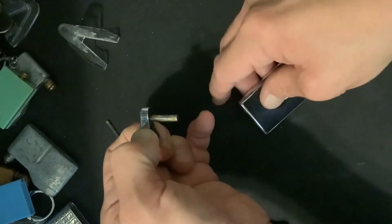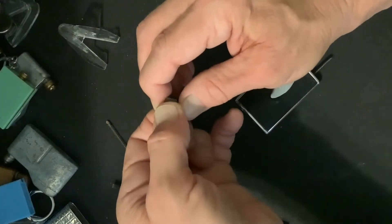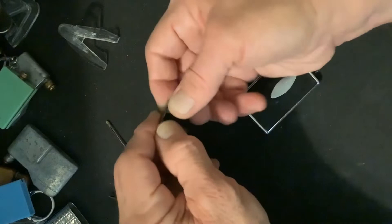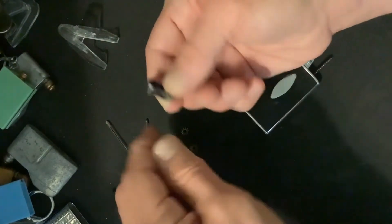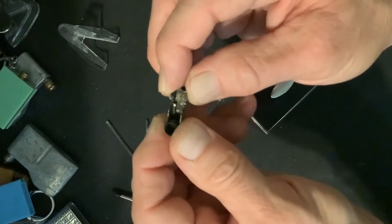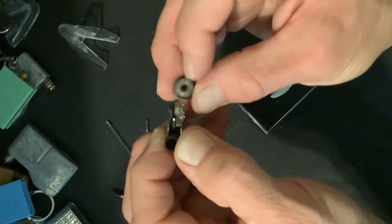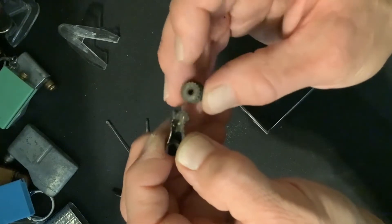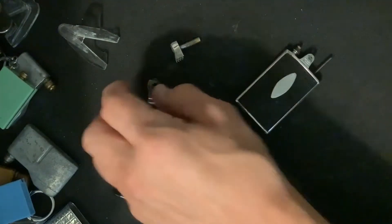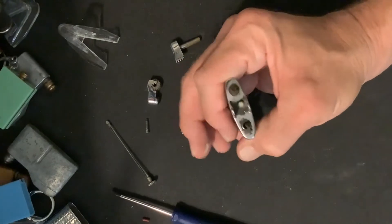This whole mechanism should come up and out. Leave that spring in place. Now we have our thumb lever, and then your typical Ronson outside full gears. We've got our file wheel, and the clutch spring is integrated there underneath the snuffer cap. That will work with the teeth on the side of the wheel to engage as it is intended to. There you can see our obstruction, so we will go ahead and work on that.